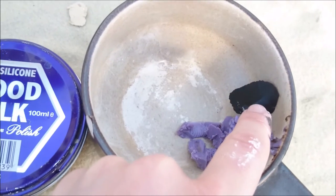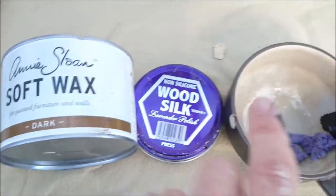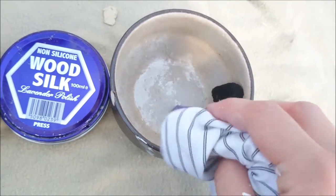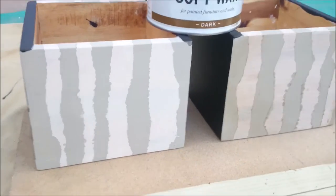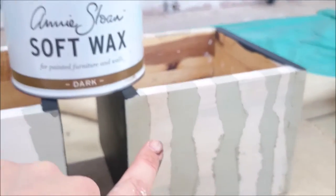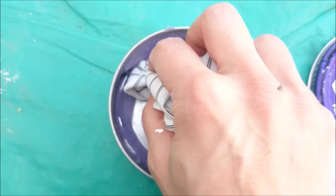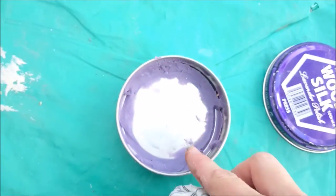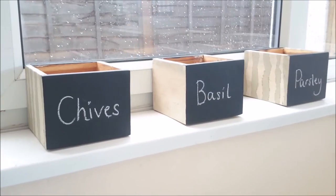In a bowl I've got an equal amount of Annie Sloan dark wax and some Wood Silk lavender polish. I'm going to apply that, mixing it together with a lint-free cloth and only going over this section. Here's before without any dark wax, and after with Annie Sloan dark wax. Then to take any excess wax off, just dab a new lint-free cloth into the clear wax and wipe it again — and there you go, the finished project.